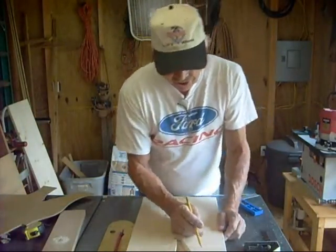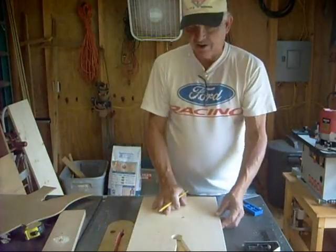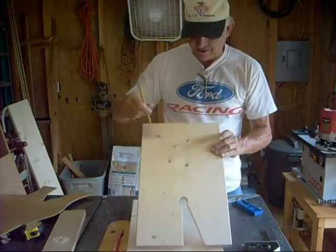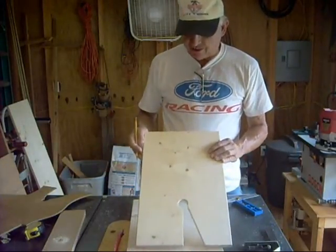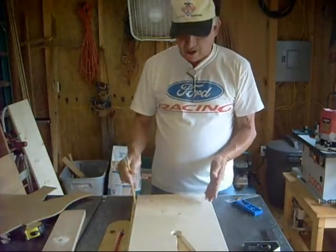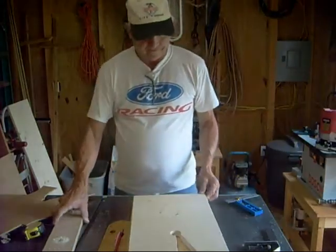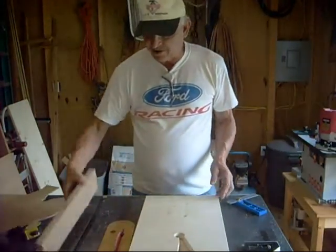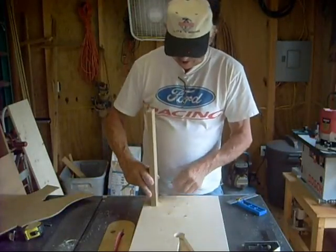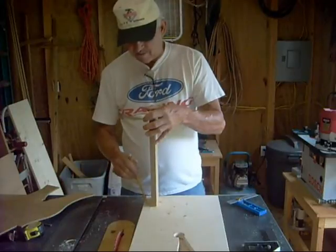The top of my bench is the same width as this piece here. So this would be the top up here. It looks stupid being that way. You want the top of your bench to overhang the sides a little bit. So, we're using 3/4 inch material here. This is 3/4 of an inch. So I want that to sit plus an overhang.